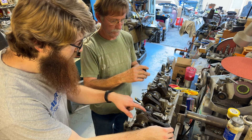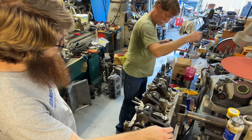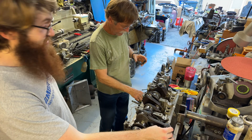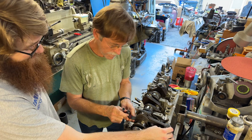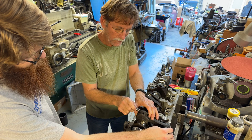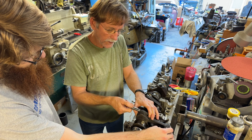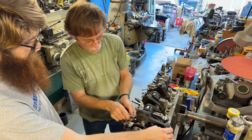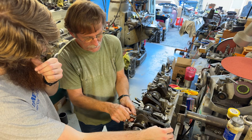Because everything's going to be sideways, it won't take up enough clearance to matter. Tang is up, so numbers up. And you always want to line the tangs up — so if the tang is up on one side, which is also numbered as number one, then the tang on the opposite side needs to be up. Don't ever reverse the tang.